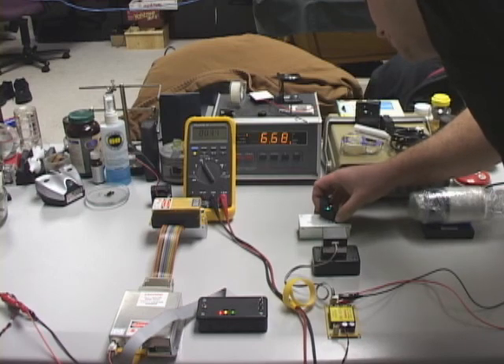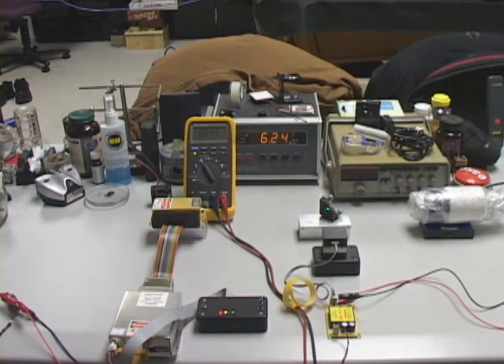That's about 45 degrees. As you can see, we're reading 6 milliwatts going through the optic and a waste beam of around 3 milliwatts. That's quite significant when you're dealing with higher power levels. Again, this is only 10 milliwatts, but I wanted to pick a laser that had good stability.